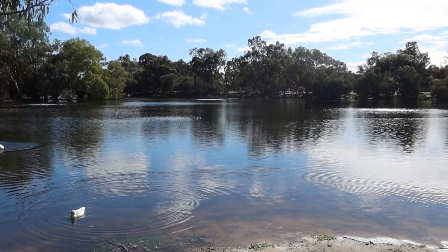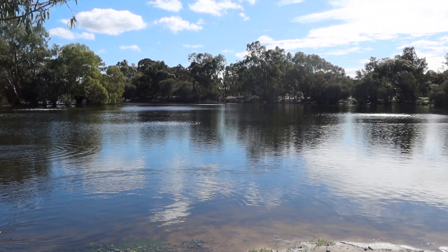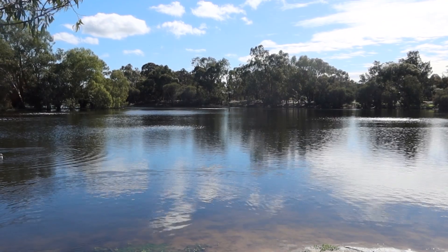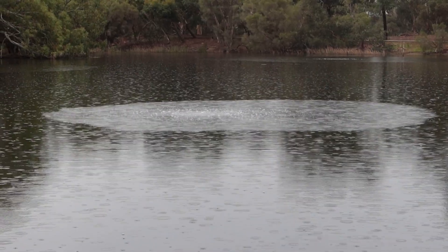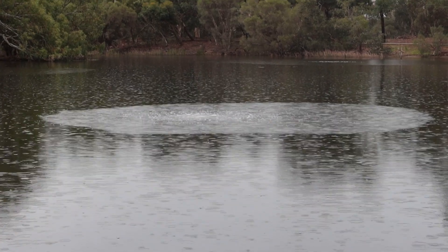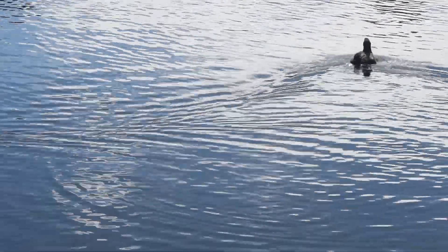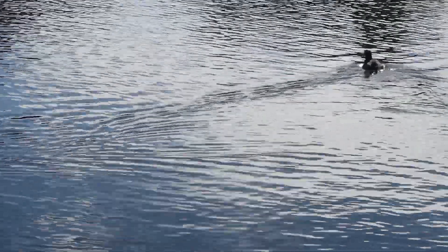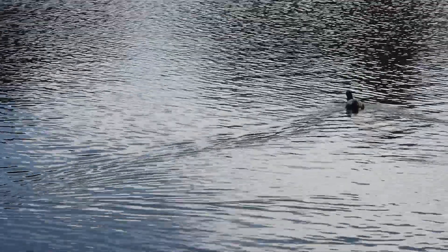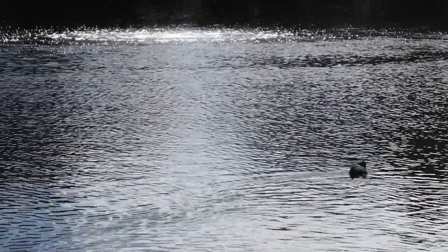In this application there are air stations probably 200-300 metres away from where the actual compressor is. And because there's nothing on the surface of the water, these aerators don't impact on your aesthetics very much at all. All you're going to see on the surface is a boil of water where the bubbles and the water from the bottom are breaching the top. They've got very low operating costs because you're pumping air not water, so they use heaps less power than surface aerators. They really are such a unique, really useful tool for aerating large water bodies.